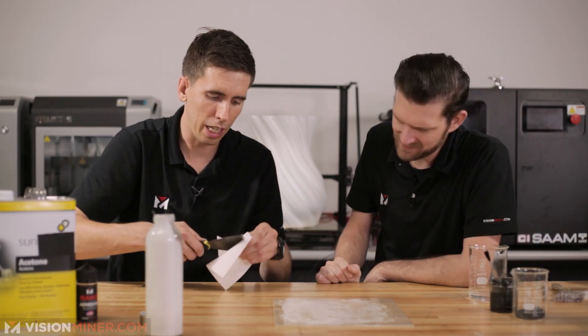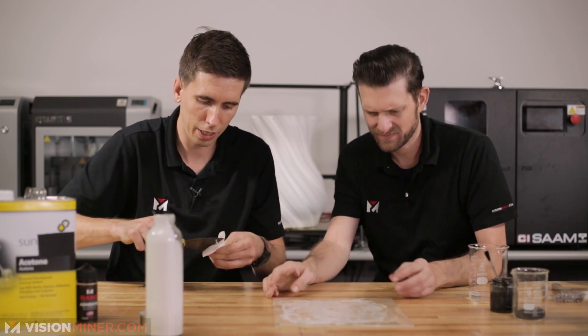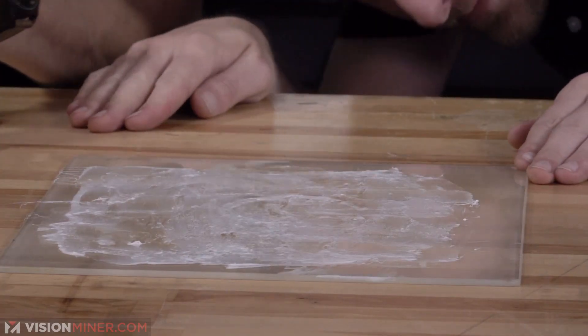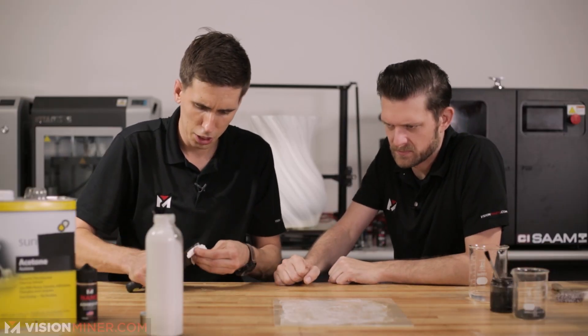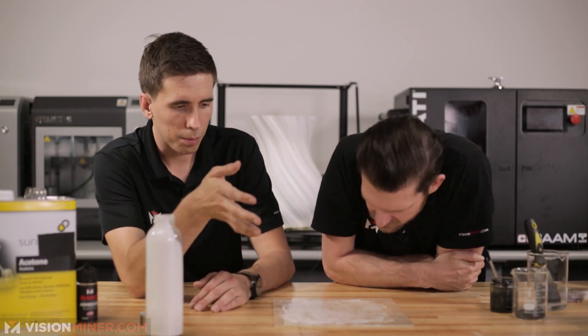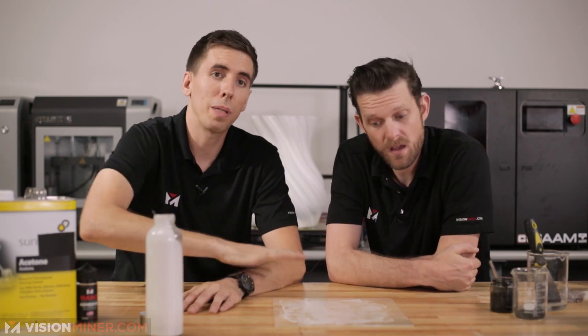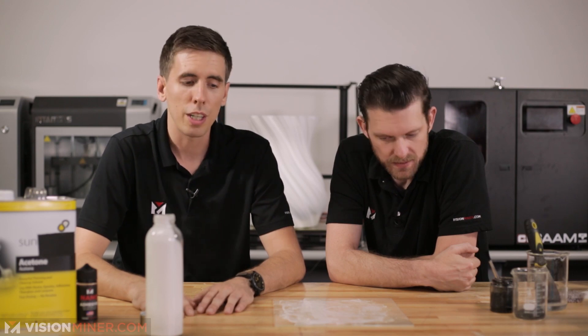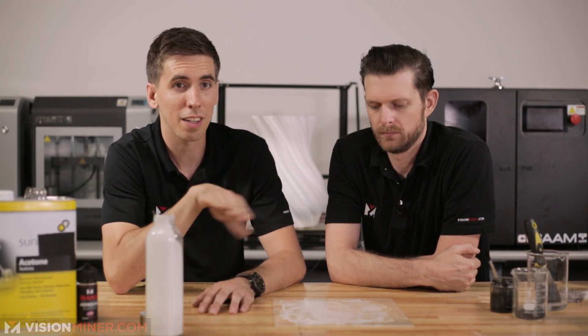You can peel it off - it's not as easy as you think. I'm probably gonna burn this off with a torch later outside. Once you've got this coating, you can print on it. You could also sand it down to make it more even - it's ABS, it's very sandable as a post-process. You could try melting it off with acetone, but in my experience it still leaves a residue that I could never fully get off the plate.